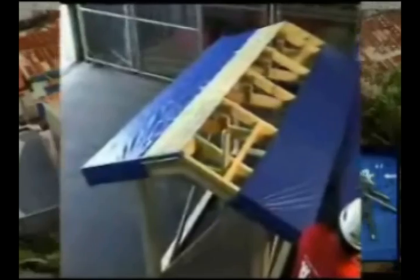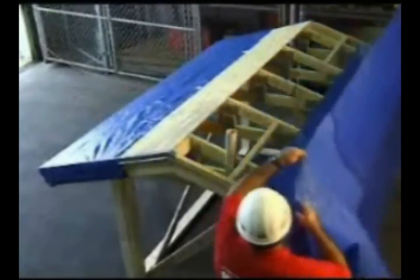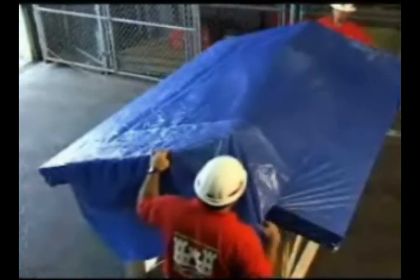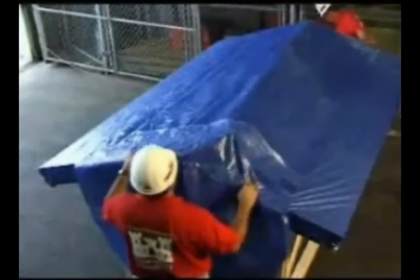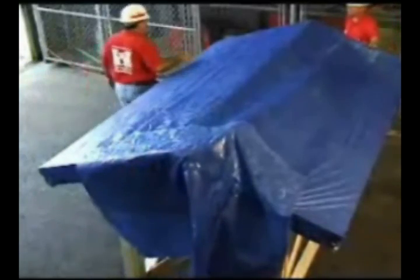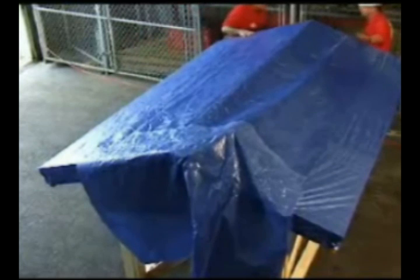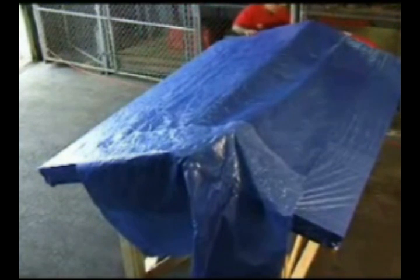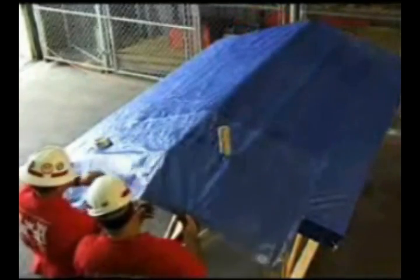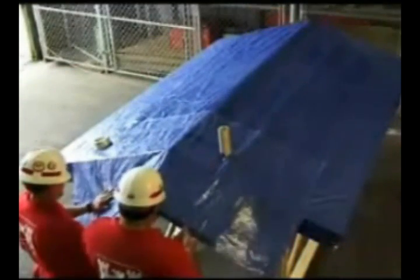Step 4. The remaining portion of the roof, which includes the ridge portion, will require at least a 2-foot overlap of plastic over the ridge to the opposite side of the ridge, covering the plastic already installed. Cut a strip of plastic sheeting the length of the roof and wide enough to overlap the already installed plastic sheeting and lay over the roof ridge. We will call this wide strip of plastic the ridge strip.